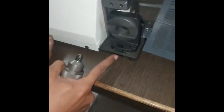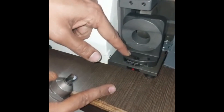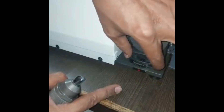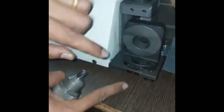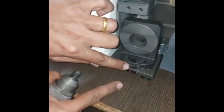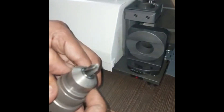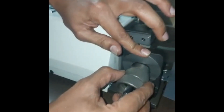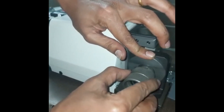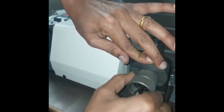This is the cam. This is set at 118 degrees included angle. We can loosen the Allen key here and adjust the included angle from 90 degrees up to 140 degrees using this arrow. You can see these two slots — the shoulders have to fit into the slot. We plunge it in straight with a very delicate hand.